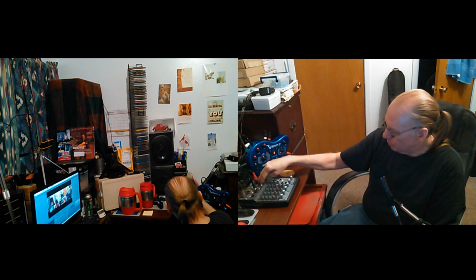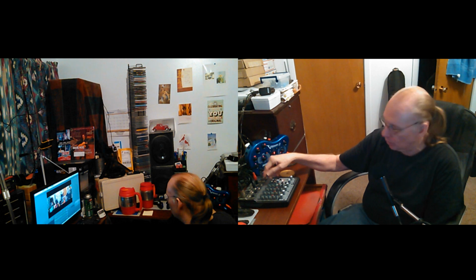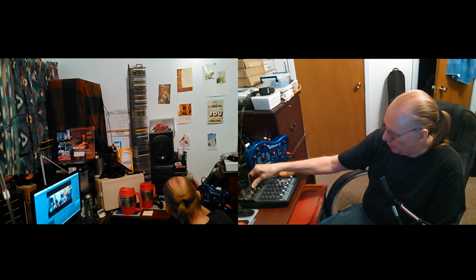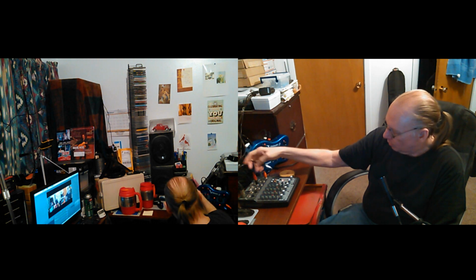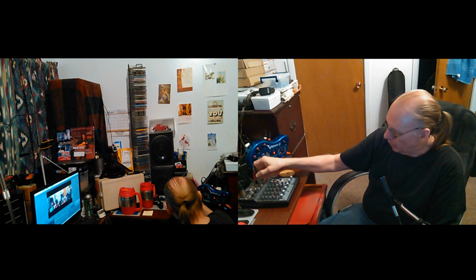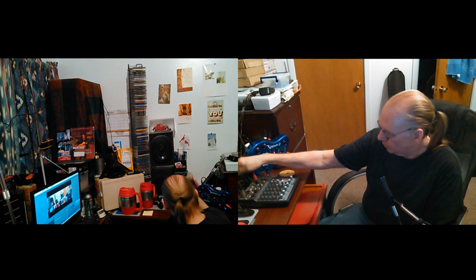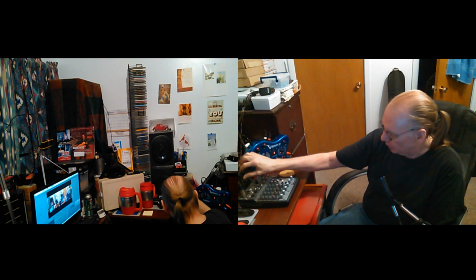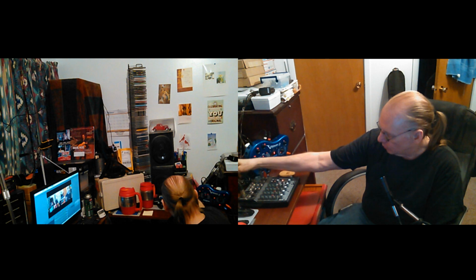Anyway, there's channel 1, channel 2, which are mic channels with a gain and everything. And then there's 3 and 4, 5 and 6, which are stereo channels. What this is, is just RCAs coming from my cassette deck over there. You should be able to put them right and left, like that. But when you do that, as soon as you plug into the right channel, it mutes, or kills, if there's a malfunction, the left channel. I read the manual, went through the manual, and it says that it would do what I expect it to do. And what the other older Mackies did, not Mackies, they didn't really have stereo channels back in the 90s, but Behringer started coming out with the stereo channels. I guess there might have been some Mackies but the ones I used didn't have a stereo channel. So anyway,